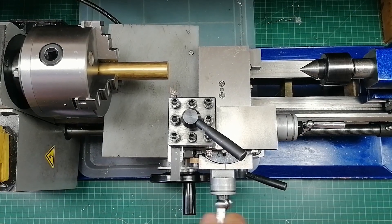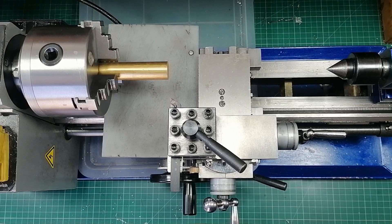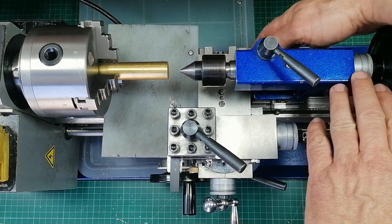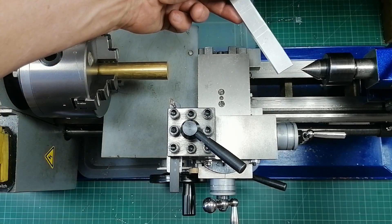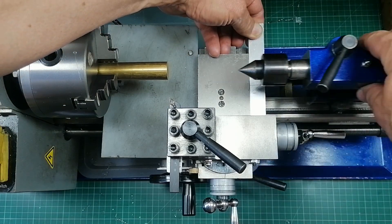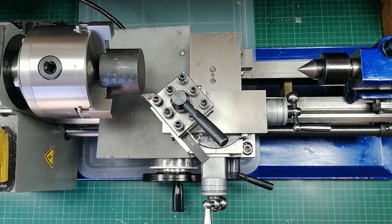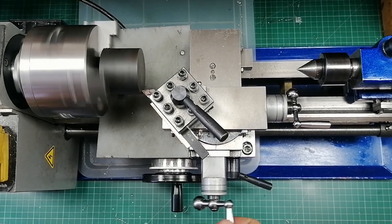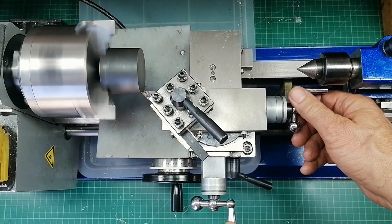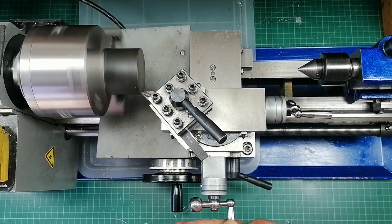Some people install a lock between the saddle and the tailstock. That's strong, because it clamps both of the ways. But on a mini lathe, it steals precious space. On my machine, the tailstock wheel only has 40mm of travel. If I add a 20mm lock there, that's half my travel gone — no thanks. Other people use the half-nuts to lock the saddle. That works, but it's awkward. You can't always lock the saddle in the exact spot you want for facing. You end up shuffling the compound slide to get the toolpost in position. It works in a pinch, but it's a pain to do every time.